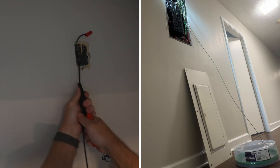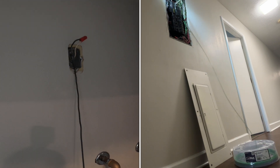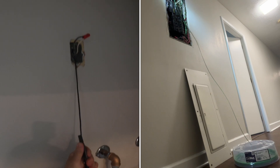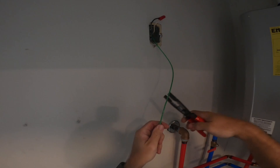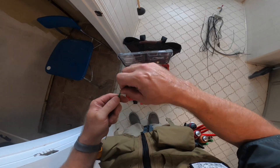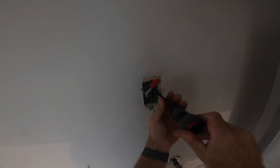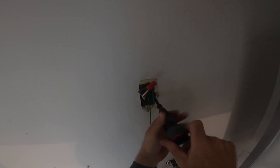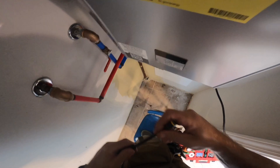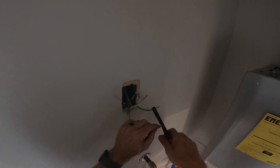I love the coil packs — I like them way better than wires on spools where you have to set up. It wasn't too bad of a pull; there were a few elbows up in there I think. Now I'm going to install a pigtail ground to the box itself. Even though technically the conduit goes all the way back to the panel and acts as a ground, I like to go ahead and put a ground pigtail in every single metal box. You're supposed to anyways, but back in the day they just used the boxes and conduit as grounds — that's why there wasn't one in there before.